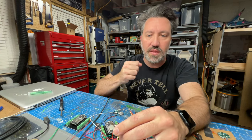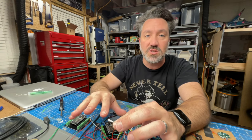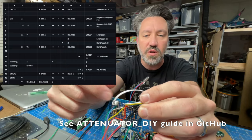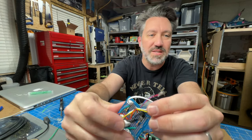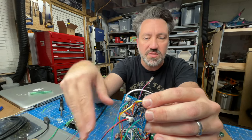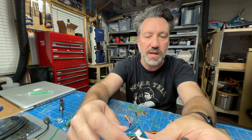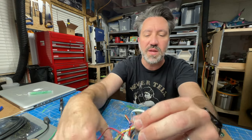When you flip the switch back and it's no longer connected to ground, that's where you need the pull-up resistor. There's a little PCB I've made — it's all documented. This might be one of the things we'll have to build out as a kit component, but this is basically how we started with the rest of the GP Star hardware. Michael came up with the resistors and transistors needed; we breadboarded it, confirmed it worked, documented it, and now we can start designing other components around it.